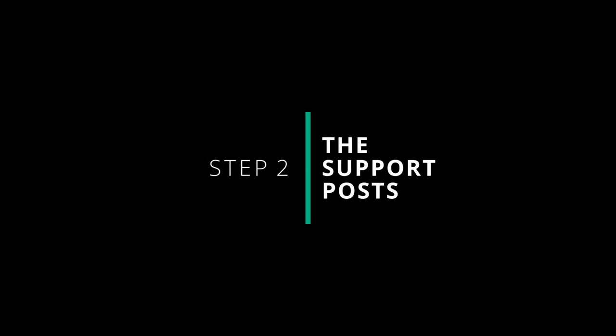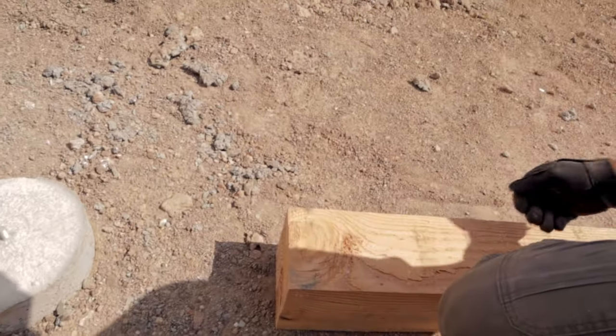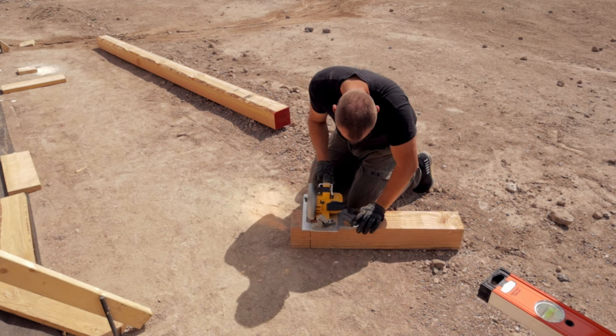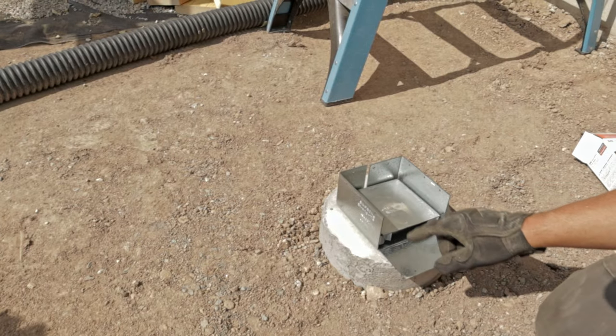When you go to put these posts in, one thing I like to check is that I'm not putting the knots where I may have to cut. On this board specifically there's a knot right here — we may have to trim these down just a couple of inches, and I don't want to trim through that. Knots tend to bind up my blades, they're hard to screw through, they're just not fun to work with. So I'm going to put the bolt in a little bit higher. As you can see it's rocking on there — it's not going to be an even surface. You can take a hacksaw, a grinding blade, anything you want to take that top off.